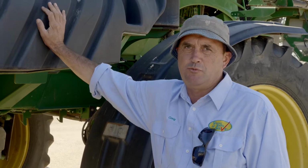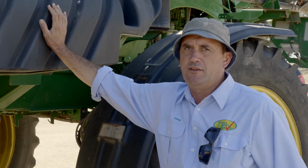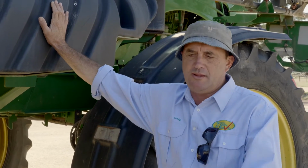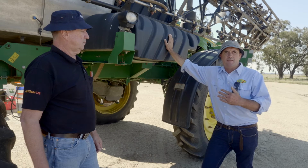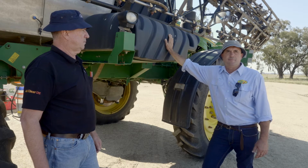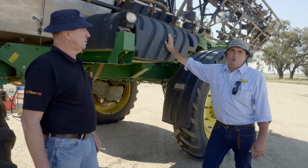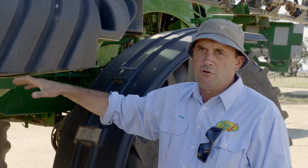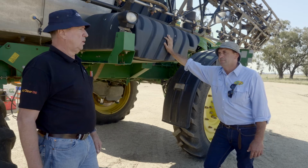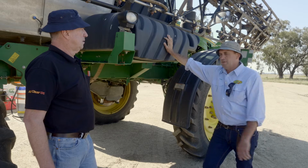I always treat these freshwater tanks as though they're contaminated. And if we do put some cleaning agent through the freshwater tank, it means as we drag that through the sprayer, we're getting it on the other side of those taps. So any dead ends where chemistry has come back against, it's a really good opportunity to get some real problem areas. I've seen a lot of spray jobs go wrong because there was contamination in this because a one-way valve's gone wrong or it's bled back through the system. Or it's been contaminated when it's been filled. Yep, in the transfer of pipes over here.